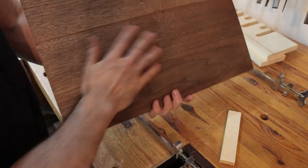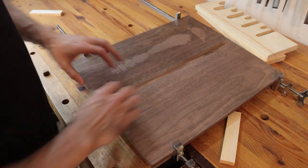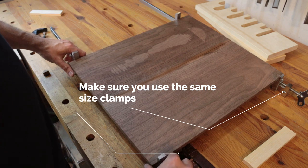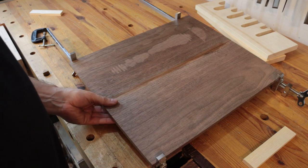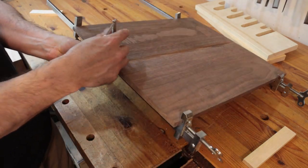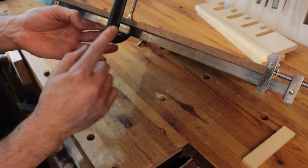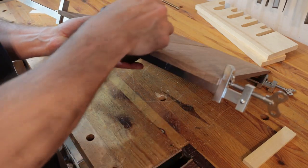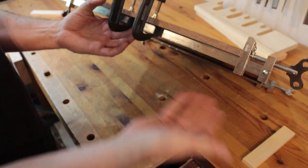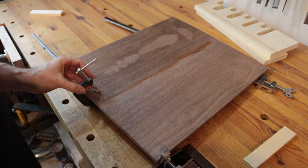What I did was I took the side that I want to use for the top of the table and made sure that it was down flat against the clamps — the bottom edge of the clamps. Then I used many clamps to clamp this together, though I'm only using two for demonstration. I took the clamps on the end and moved them to the very end of the board and applied gentle pressure just to get them to start sticking. Then I took smaller clamps and attached them to the bottom of the clamp that the board is lying on. In my case I only used one, but you can use two, and that will ensure that both panels on top are now flat — so this surface will turn out flat as well.